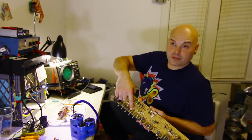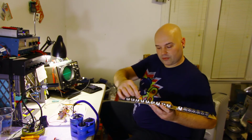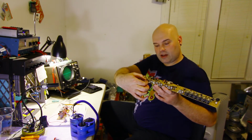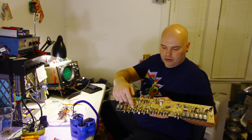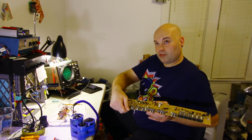These support the potentiometers, and these are full-size regular pots. And they're screwed into the front of the chassis, the front of the metal chassis. The nut goes on here, so this is being held into the front of the chassis, and each one of these pots has a metal support on it that's soldered into the board so that they can't be jerked loose.